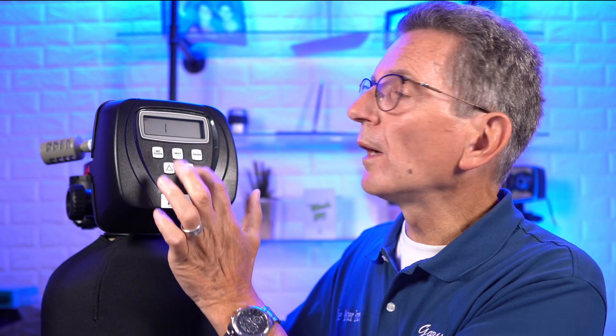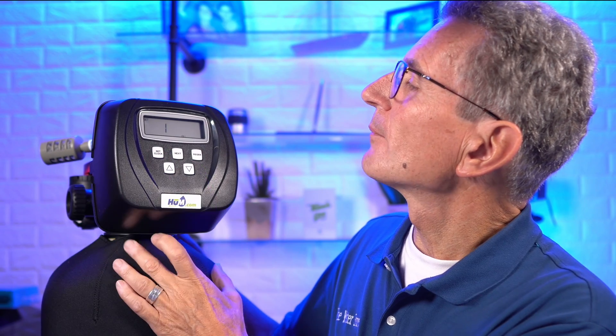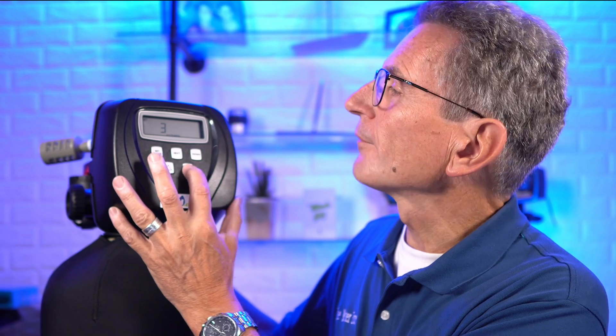The first cycle is backwash — you'll see '1' and then the word 'backwash' flashing. We want to have one backwash, so press next. Then '2' says 'down brine' — that's what we want. If something else is set up like 'rinse' then you need to change it. Press next and it says '3 backwash' — this is something we want to change. An air over media iron sulfur filter only has two cycles: the backwash cycle and what it calls 'down brine,' which is actually air draw. So change '3' to 'end' or 'off,' press next and we're back to the time.